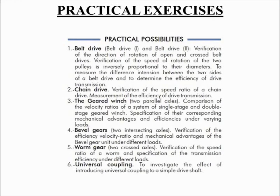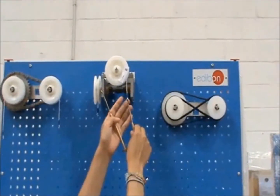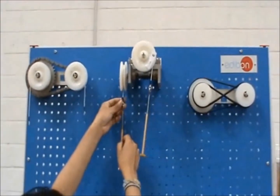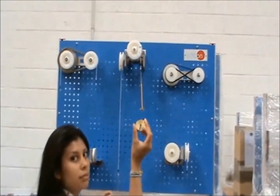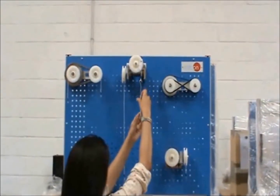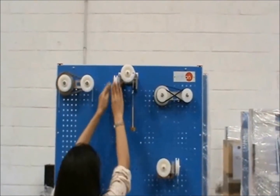Today I am going to perform the practical exercise: the worm drive. First, you have to set up the equipment with the two knurled nuts provided with the unit. Place two hooks in the 600mm course of the worm pulley and wheel pulley. Place a 1N weight on the wheel pulley and return the weight hooks to their original positions by turning the worm pulley and let it descend at a steady speed.